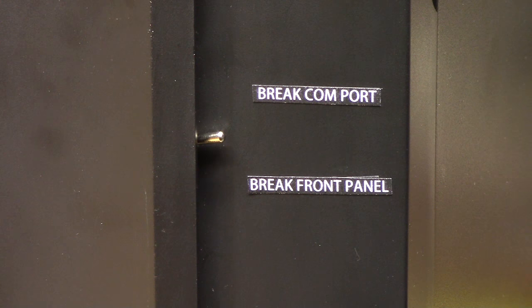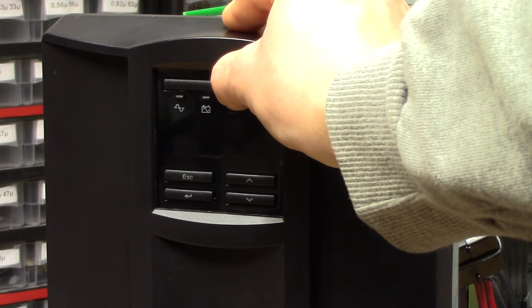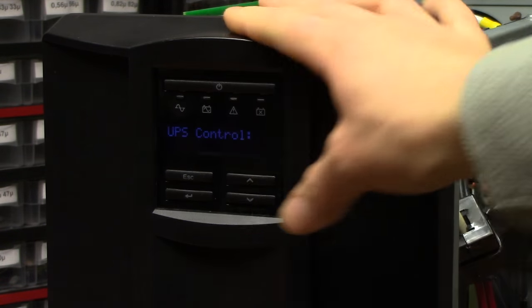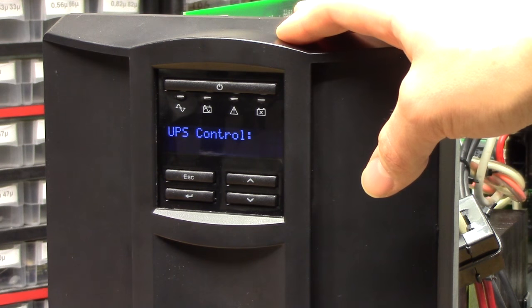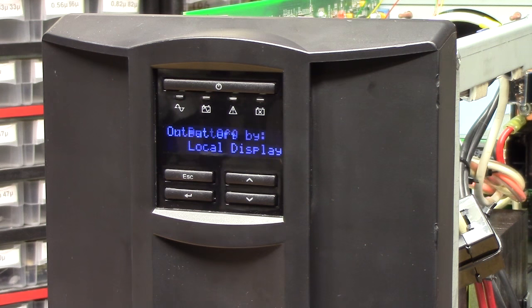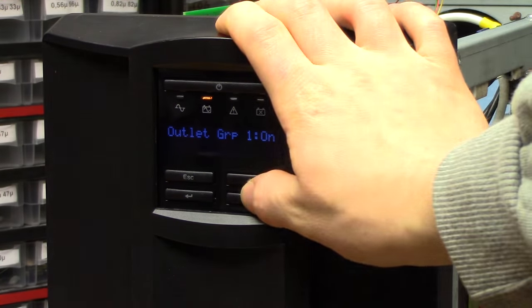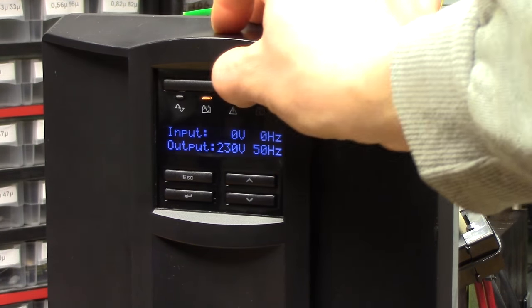There you have it — a switch. The switch is currently set to disconnect the comms processor, so we should have pretty normal front panel activity. That certainly looks pretty OK. We definitely have a working front panel without the comms processor, so let's flick the switch and see if the opposite is true as well. Now the switch has been flicked, that should not allow us to run the beeper or turn the UPS on — and that indeed seems to be the case. It will not turn off by the button.